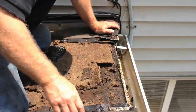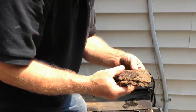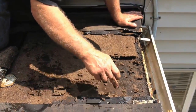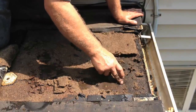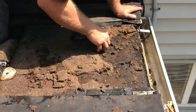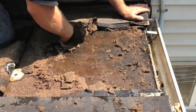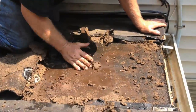This is the half-inch fiberboard that used to be there — it's disintegrated because it's wet. There's another roof underneath this that was trapping water between this membrane and this membrane. The last roofer installed fiberboard over that to install this membrane. Every roofer has his own way to do things. I'm removing this material, which is really unnecessary, and that gives me a half inch of lower roof here.